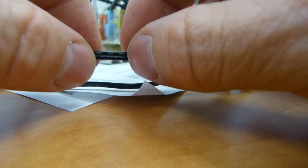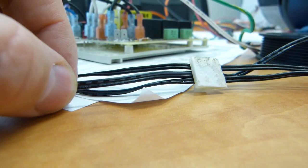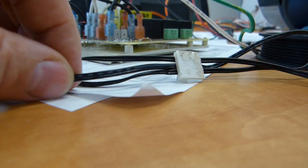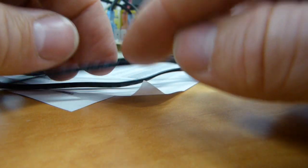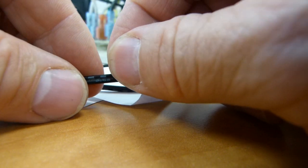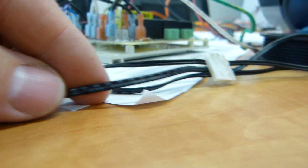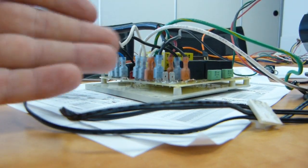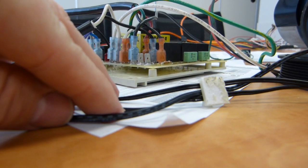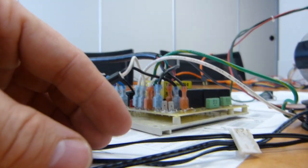That's it. It will be a point of weakness in terms of the few millivolts coming from the sensor trying to go through a choke point that's mangled, and if you try to splice it back together by twisting the wires together, this signal may never make it to the circuit board or your dashboard or control panel, whatever, but it might work. I'm just telling you these are some options. Replacing the wire is easy.